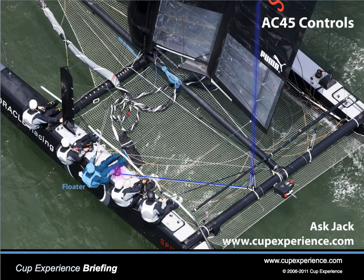That's this cable that goes up to the top of the mast and pulls back on the mast. There are 2 running backstays. The one on the other side of the boat, away from the wind, the leeward side, is this one right here, which is slack right now. You can probably see there's a difference between the distance between the pulley at the bottom of the black cable and the set of white ropes. Maybe this will help you to see a little bit what I'm talking about. The distance when one is tightened on, that pulls back on the mast.